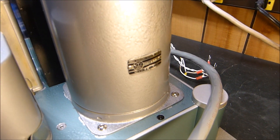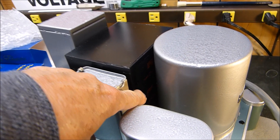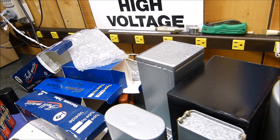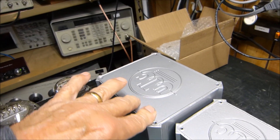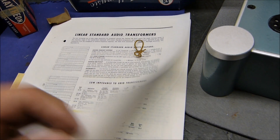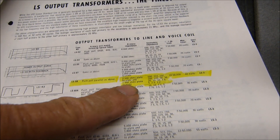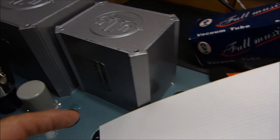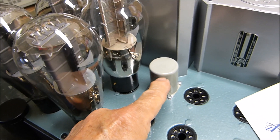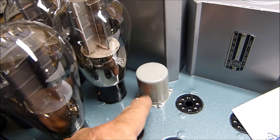This is a CG-422 UTC transformer with lots of taps, oil capacitors, and this is a filament transformer with a bunch of taps. This is a dual choke. And this right here is a UTC LS-58 — it's 2500 ohms plate-to-plate or 1500 ohms. It's a push-pull plate to push-pull grid driver. This choke here is the kind used in one of the Altec amps — it's a 300 Henry choke.